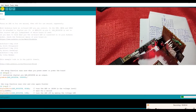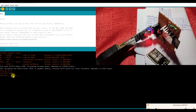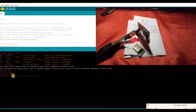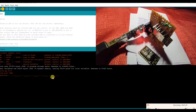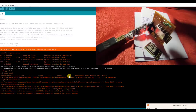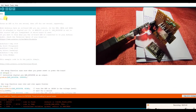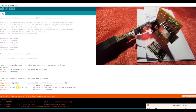Before uploading, you need to change the built-in LED pin to pin 2, which is the built-in LED of the ESP8266 module. It's showing underscores and dots but not uploading because when you upload code to this module, you need to pull down the reset button and flash button together. The flash button is here, but I connected the DTR pin to the reset of the ESP8266 module, so I have to press the flash button while it's resetting.